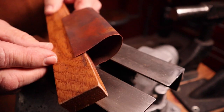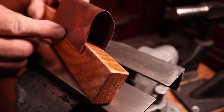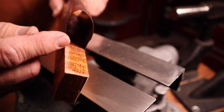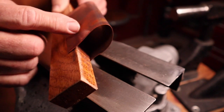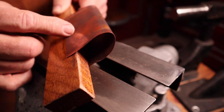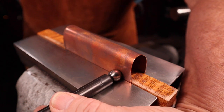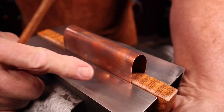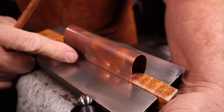One of the ways I like to use is to put my piece of metal onto a piece of wood and chuck the whole thing up into the vise. This leaves the area down here at the bottom nice and wide, so I can be pushing in and texturing on the lower area without it collapsing onto itself. Now we have plenty of room to put our dents along the side — much wider down here. Let me just go through this and we'll see how that looks.